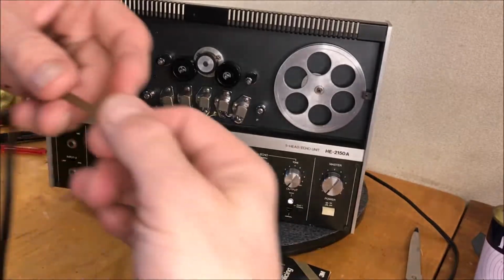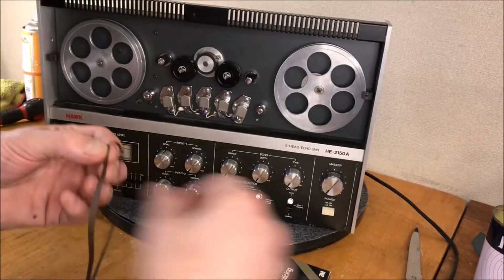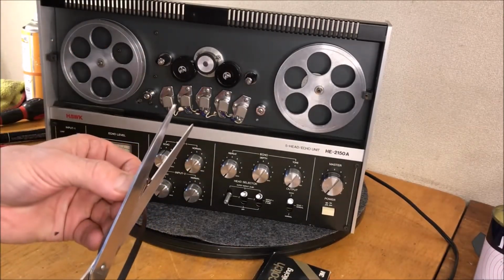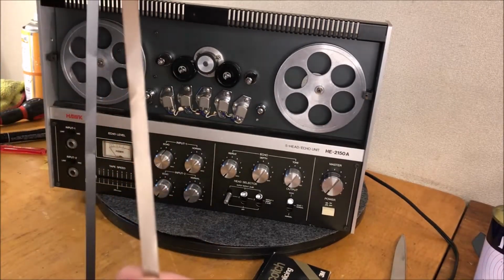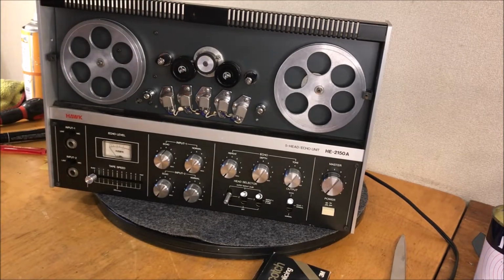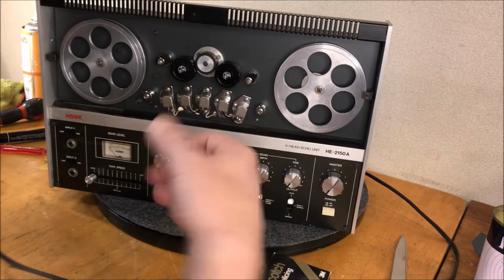All right, I think we're going to call that good. You can see we got a little bit of tape on the outside. It's not good. I'm going to fix it. A little less tape, magnetic tape. You see how I trimmed a little bit. It's better than having tape exposed, because the tape will gum up your heads. And so, okay, let's feed this baby in there and see if we got the right length.